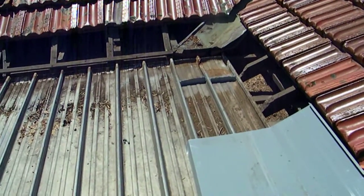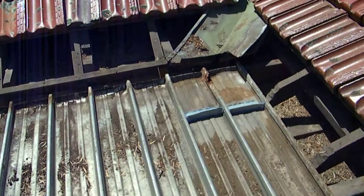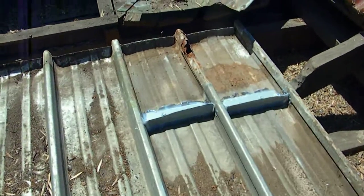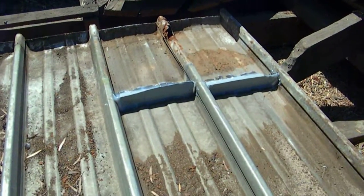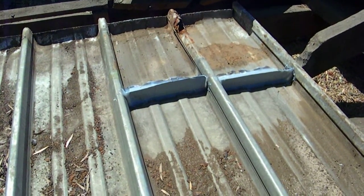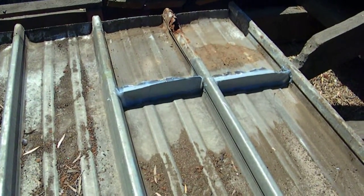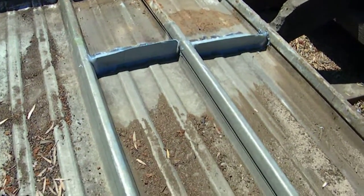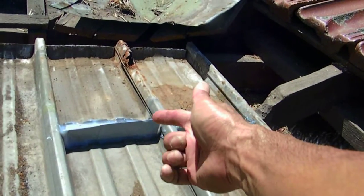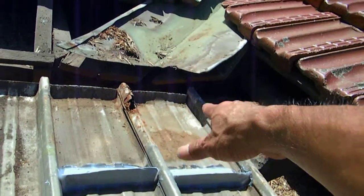There's a flashing almost ready to go into position. If you have a look at the corroded area, you can see that we have installed two additional turn-ups just downstream of where the rusted areas are. What that means is when water gets blown in from that direction, it'll get stopped by the new upturns and it won't go into the rusted area, keeping that area dry.